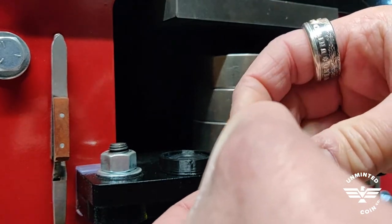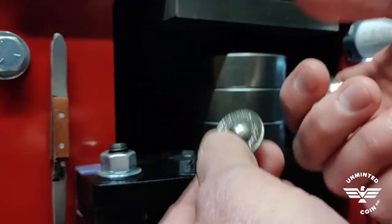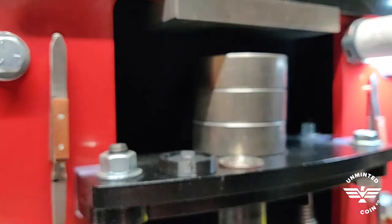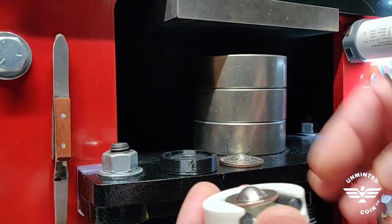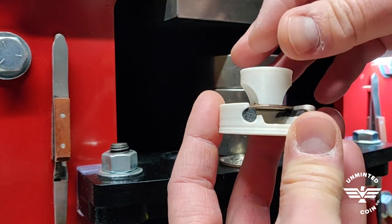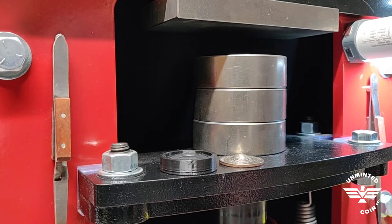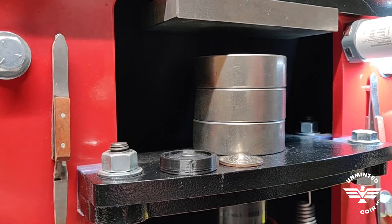Because of the crease you get from that sharp edge, it's really nice — you don't have to worry about re-annealing. Think of folding a piece of paper loosely and then trying to fold it in the other direction — you're going to get more force there. But having a sharp edge gives you a nice fold, so no need to go back and re-anneal. Then you just take the cowboy hat puck, drop that on there, put the press foot over top, and push down — again using the one-ton arbor since it doesn't take a lot of force — just until the coin touches that base.